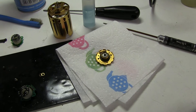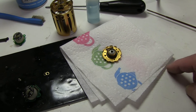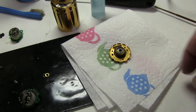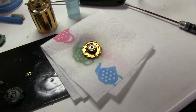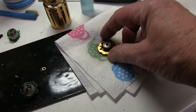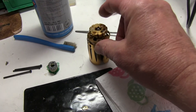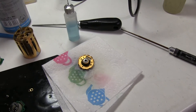Taking it apart, you can see that bearings get very dirty inside if you are not careful. They can get so much dirt in them that they cannot rotate properly. So this one, after taking it apart, needs to be cleaned up with some sort of cleaner and really flushed through, then oiled with a decent oil, and then spun up on the end of the stator shaft to see if it is going to spin. At the moment it probably won't spin because I have just cleaned it, so just clean that up a bit more.